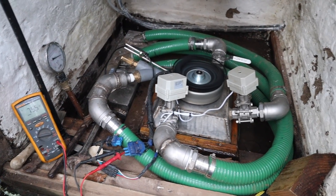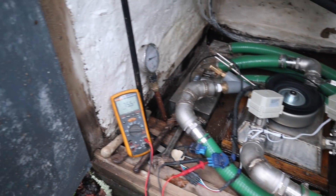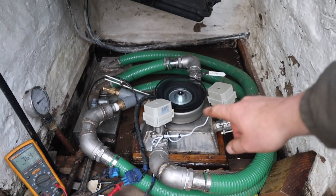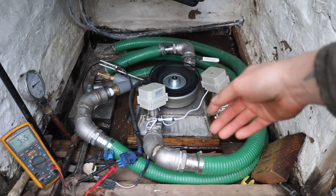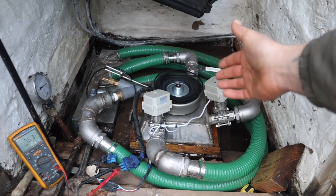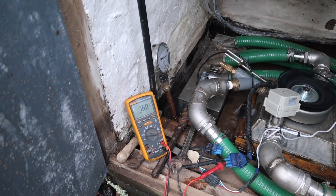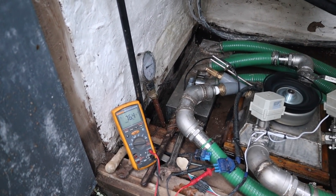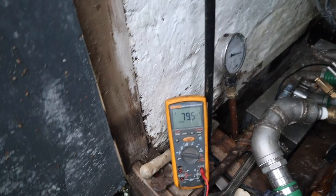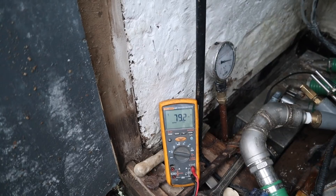Now running that at free spin and taking the voltage reading off two of the phases - we'll let that stabilise and see what the voltage is. The voltage is going to creep up because it's spinning really fast, heating up the bearing a bit more and making it more efficient with less losses as the grease gets hotter. It seems to be settling - 76.1, we'll let it stabilise. The max we've seen is 79.5.